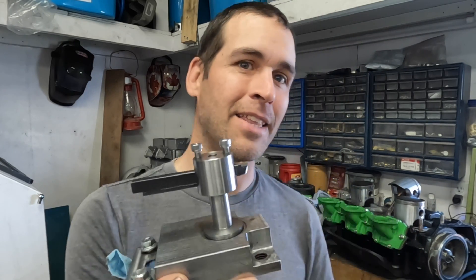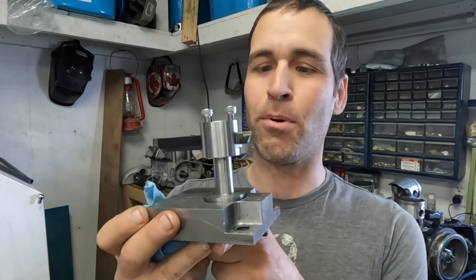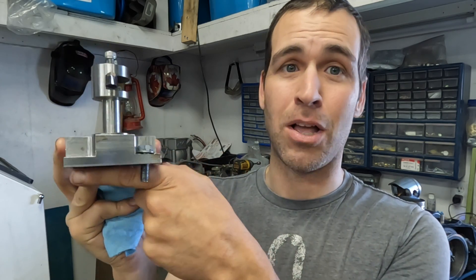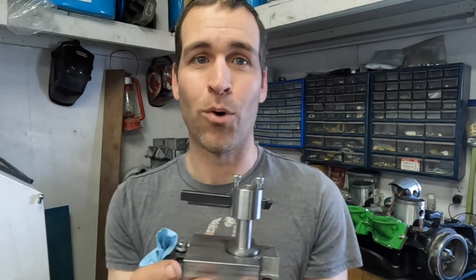That just about does it for this video. I hope you guys enjoyed - if you did, remember to leave a thumbs up, and if you want to see more of this nonsense be sure to subscribe. I will be building the cylinder head domes in a video on the Joel Ersono YouTube channel, so if you don't want to miss that go and check out that channel - link in the description below. Also, I ended up using razor blades to shim the tool up to the proper cutting height - I put razor blades between the lathe and the block of metal itself, and that worked really well. It cut perfectly on center.